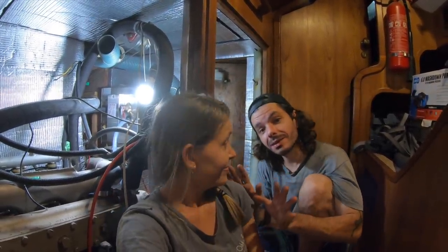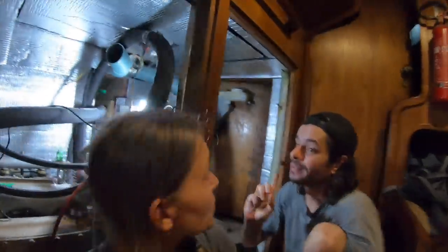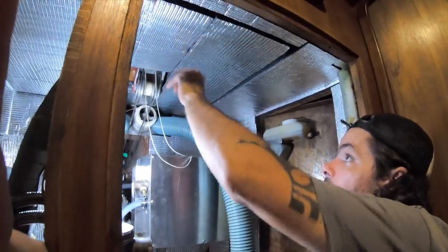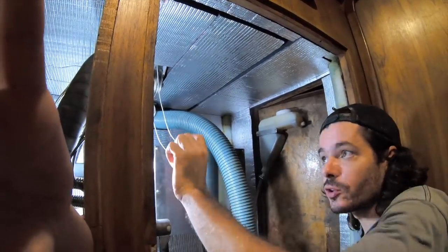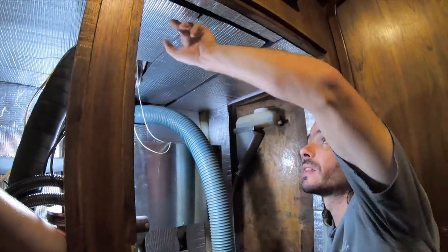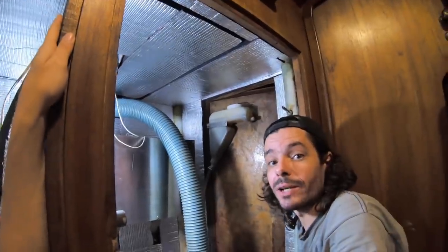We are gonna discuss that as a family, and then we're gonna decide what to do, and then we're gonna finish that. But there is also one more thing we need to do. We need to use tape around. Yeah, we want to seal all these joints because we have different panels to compose the whole engine room, and if we seal the joints really well, it's gonna seem like one material, and humidity and dust won't go inside of the foam. It's gonna be much more protected.